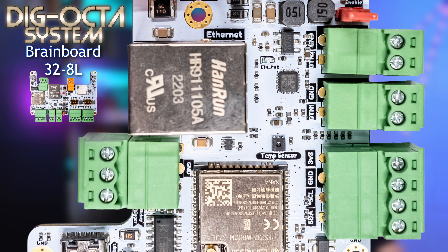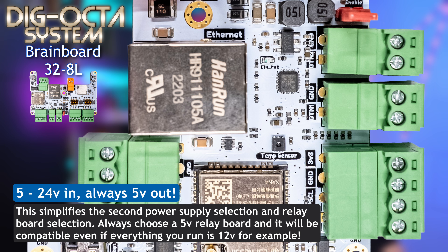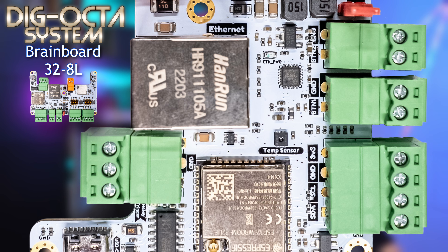Below that we find a three-pin 3.8 millimeter pluggable style connector meant for an external relay board. It features a 5.12 volt power output — always that voltage even with 24 volt in — a ground connection, and a 5.12 volt relay trigger output tied to a GPIO pin on the ESP32. This relay trigger is powered through a MOSFET circuit, so it can drive a fairly high amount of current — a lot more than a level shifter — allowing multiple relays or an SSR without a problem.